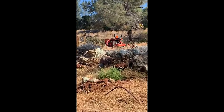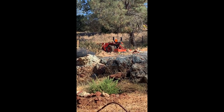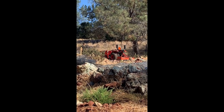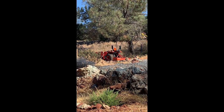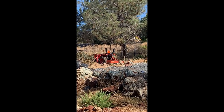And one thing I forgot to mention is there are tractor attachments for augers. And the problem with those is I have a Kubota over there, a 3301. Putting an auger attachment on that tractor is not going to do a whole lot more than the auger I showed you earlier. You can't get the torque and the downward pressure to tear through this rock.